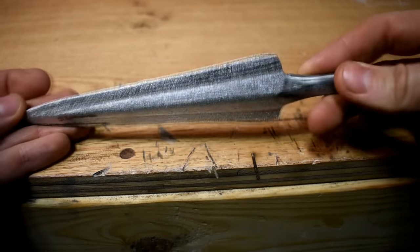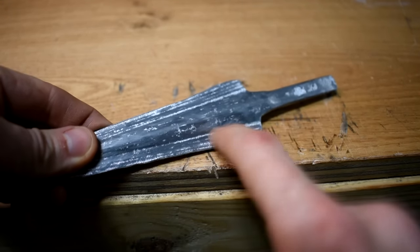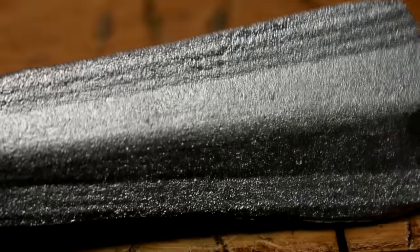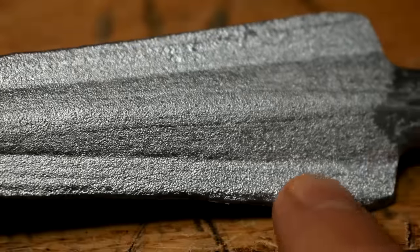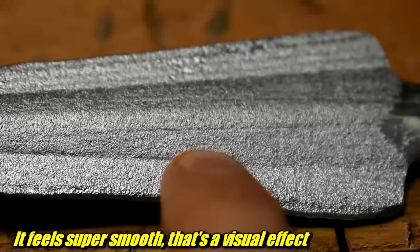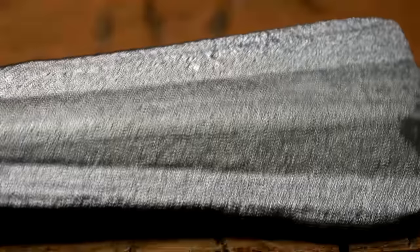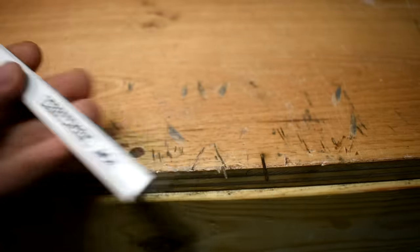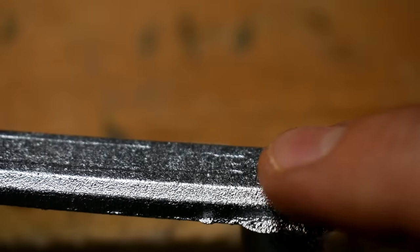And lastly, the spear point. I have two sides of this. This side I hit with just a 120-grit flap disc to try to shine it up — I didn't want to grind away all the details like these ridges that came through. It's definitely kind of shiny, shiny enough to mess with my camera. This is the as-cast texture, and you can see a couple of key things. First, these ridges are showing through — those are in the pattern — and it did preserve all of that detail. Second, see how rough that surface is? It's rough because this metal is so flowy it actually conforms to the shape of the sand grains a little better. So we're in store for some really highly detailed castings, at least possibly with this zinc alloy — or highly shiny ones. Which do you like better, the sandy or the shiny? And one last thing — remember this pencil? Craftsman and Ace are stamped in it. If you take a look, you can almost see the word Ace in the casting. You can't really read Craftsman, although you can see where it goes, but you can almost read Ace. How cool is that?